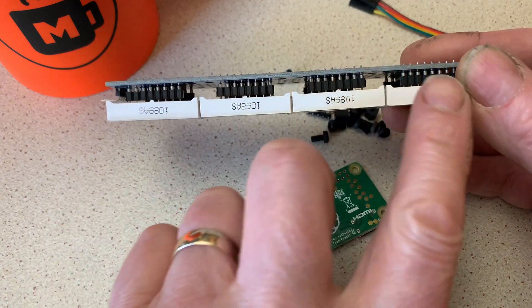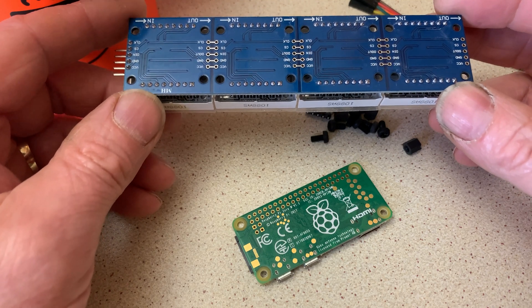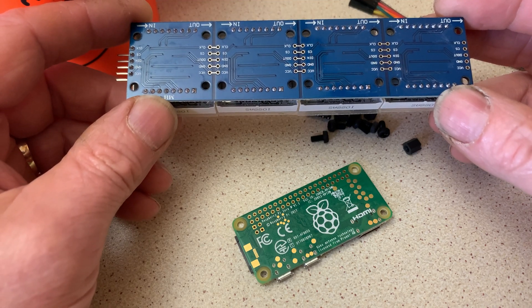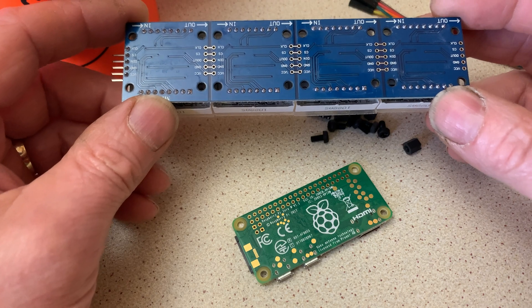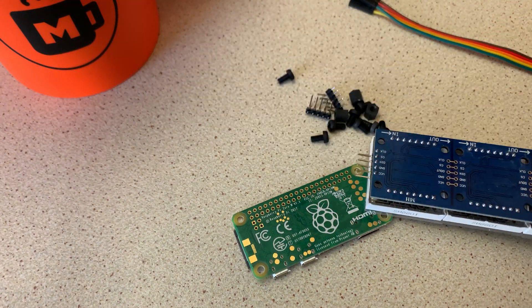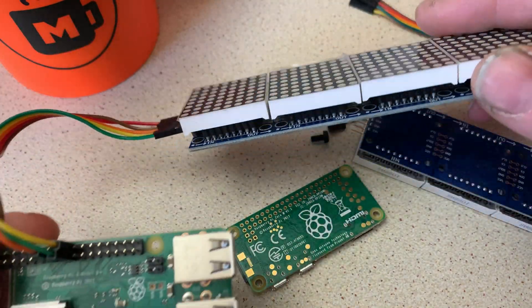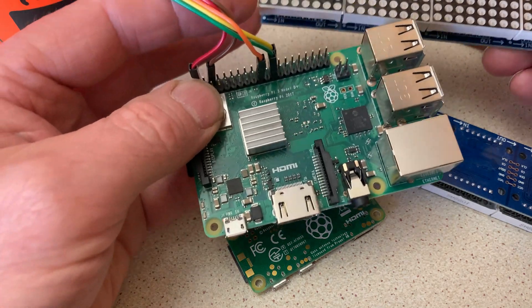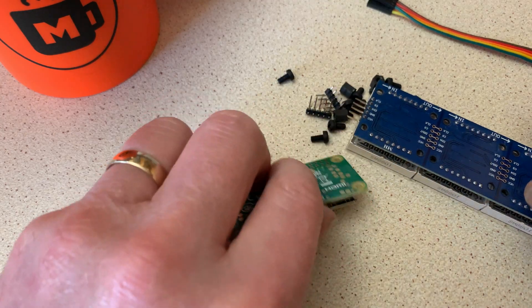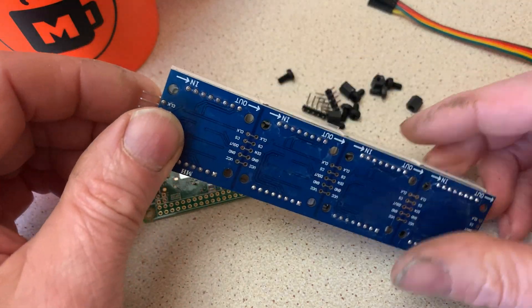We'll start with the hardware. As you can see, this is like four sections — it's a serial interface. The pin numbers are going to be two and six for ground and plus five volt supply, and 19, 23, and 24, which are GPIO 8, 10, and 11 of the Raspberry Pi. I'm working with a Zero, but there's nothing to stop you using a Raspberry Pi 3. The Pi 3 was a better test bed since the Raspberry Pi Zero is a lot slower.